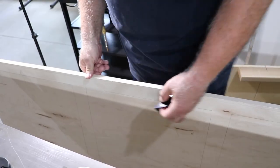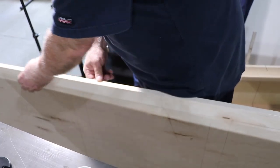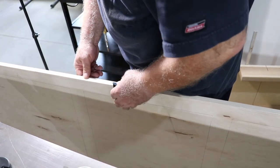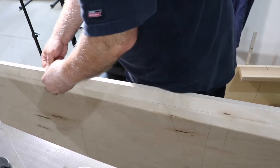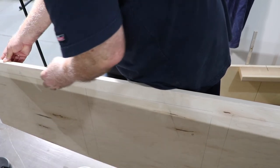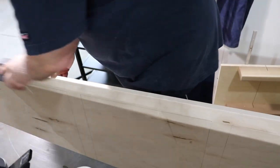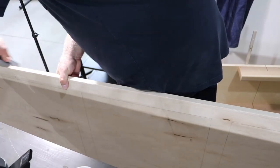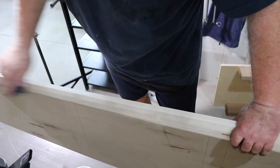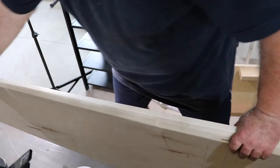There are a couple of big visible edges on the plywood — particularly the sides of the cabinet — so you need to dress that up. The instructions recommend edge banding and that's what I did. I ordered a 250-foot roll of maple edge banding, three-quarter inch, from Amazon — that was another 30 bucks. I applied it with an iron, there are quite a few videos on YouTube about edge banding, and then I used a little hand plane to trim it and finished up sanding it smooth. It actually worked out pretty well.